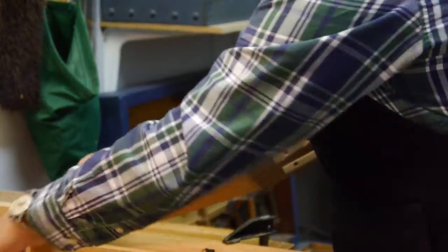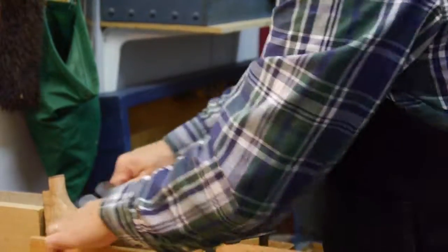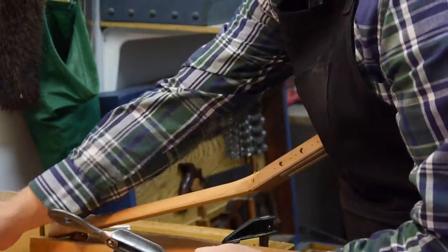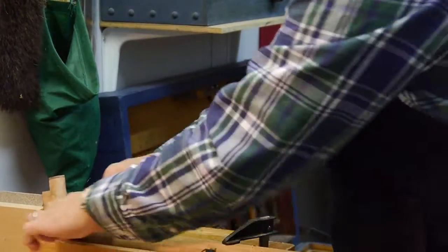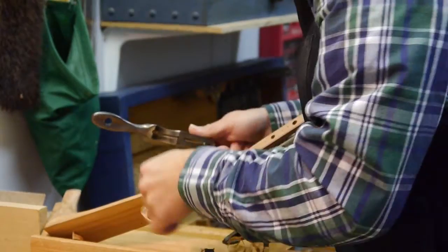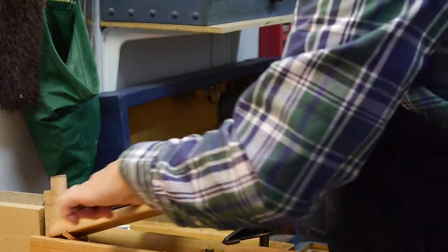I'm going to use the flat side for little notches where the round won't get. Now, this is a parlor guitar, and parlor guitars had a sort of a V-neck as they went in. So I want to maintain a center here and stay away from the center line. If you wanted to, you could draw a center line down there to help you with that. Once this thing starts to conform to my plane or my spokeshave, I'm going to be getting close to the right curve. Then I can kind of ease up a little bit and do a little bit down the middle.